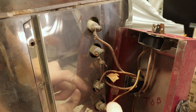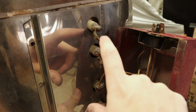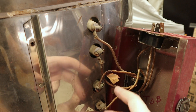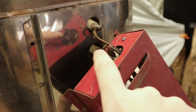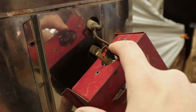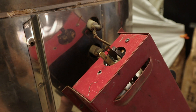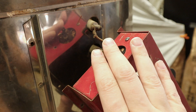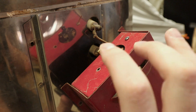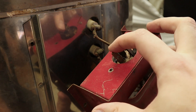Here are the pairs of elements coming out of the top section of the kiln. This one's different — there are actually screw connectors here, which is great, because it means replacing these wires will be way easier. Here's the switch poking off the side — that just turns on pairs of elements. Here's the plug. This is the one that was actually broken on the inside of the middle box, and this terminal here looks in really bad shape. The problem is this connection between the top section and the middle section with these plugs is both mechanical and electrical, so if the rings are offset even slightly, these would get bent out of shape very easily.